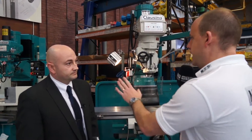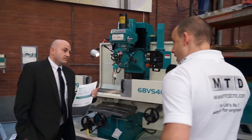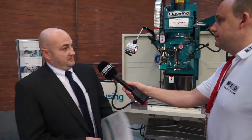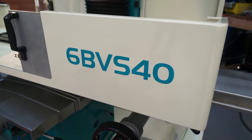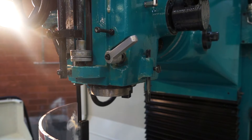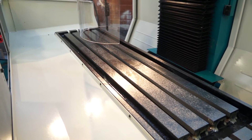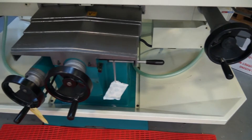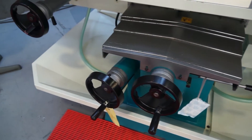And then back one more — going bigger again. Now this is the entry level into the bed milling machine for us. Again this is a lot heavier duty, and what this enables you to do — it's got an ISO 40 spindle taper — but it's actually the table load that you can put on here. This machine can handle up to 800kg, enabling heavier duty and larger workpieces as well.